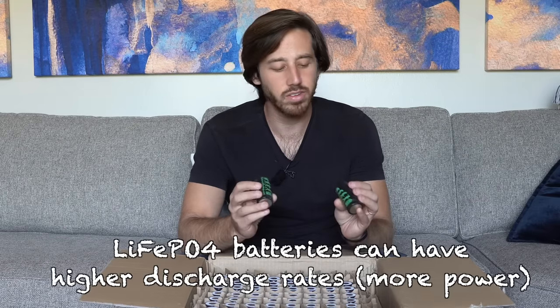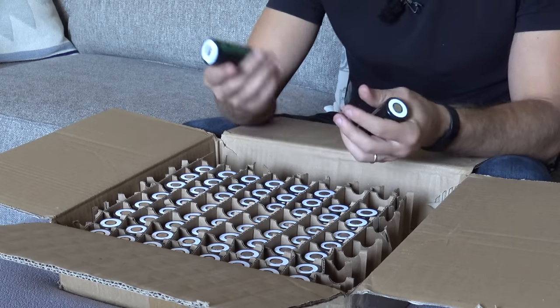Another advantage of lithium iron phosphate is that you can often get higher discharge. These cells are rated for 3C, so at a 5 amp hour cell you can get 15 amps out of each cell. It varies depending on the type — some cells like A123 cells can go up to 20-25C, which were very popular a few years ago. The chemistry does allow higher power, and lithium iron phosphate also doesn't heat up as much during high power use. So if you're going to pull a lot of current, lithium iron phosphate can help cut down on heat buildup.